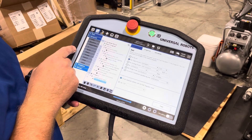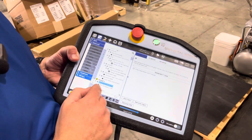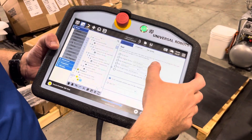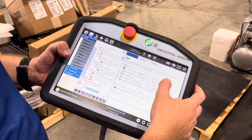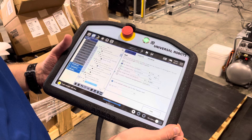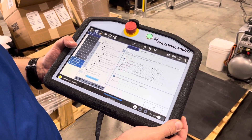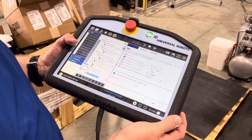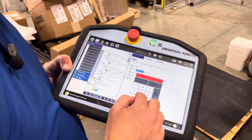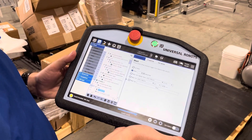So I'm going to go back up to basic and go to set digital output — call that conveyor one — and turn that to high. High is on, low is off. So we've got that. Then we just want to add some logic for when that is on, we want to stop moving the conveyor so we don't tear up the belt — we're not putting a bunch of back pressure on there. So if you go back up to your if statement and do else, now we're going to go back up to basic and do a set digital output conveyor one to low. In this case our sensor is right at the end stop, but sometimes because of physical constraints it needs to be farther upstream. So we want the conveyor to run for a quarter of a second or a half a second after it's triggered before we shut it off, so we know it's nested at the end stop. So you can go ahead and do a wait of 0.25 seconds. And we want that above the off. So you can see the flexibility — we can move that around where needed if it was inserted in the incorrect location.